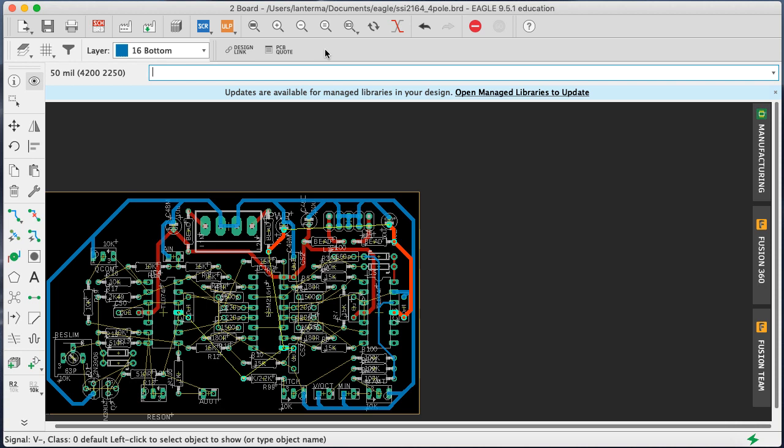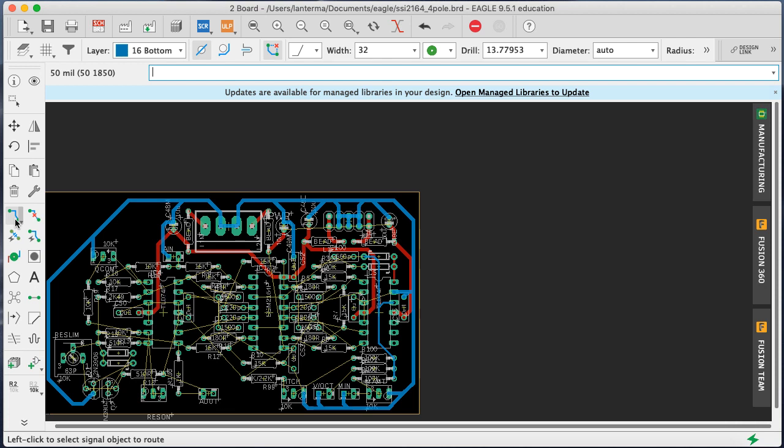The main reason is that you may come up with a better layout of parts that you won't notice if you use the auto router. The other thing is the auto router tends to pull things in very tight according to some algorithm, but I like to have the traces be something where, when I'm trying to debug the board, I can follow what's going on.